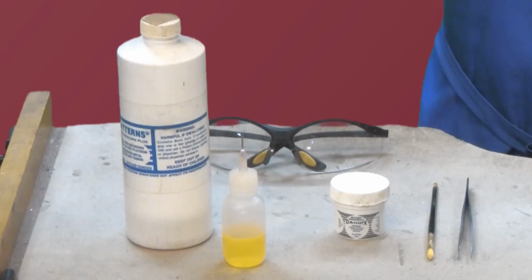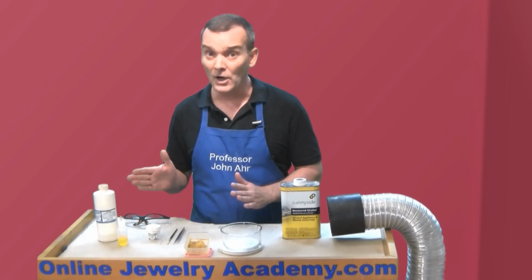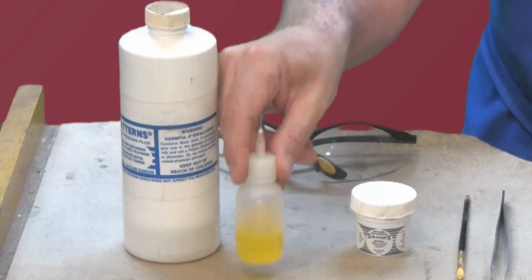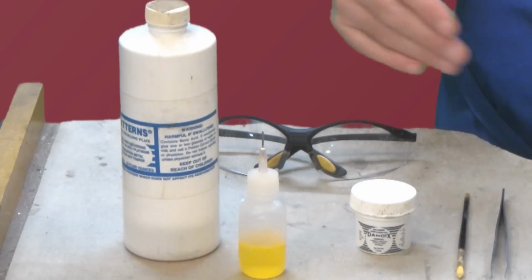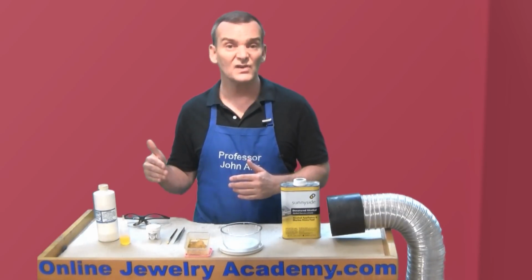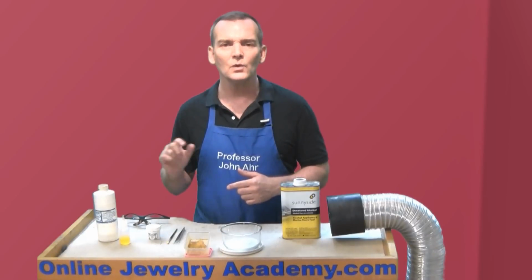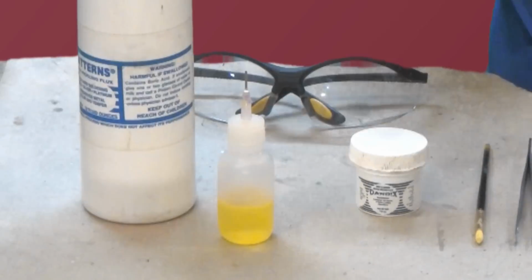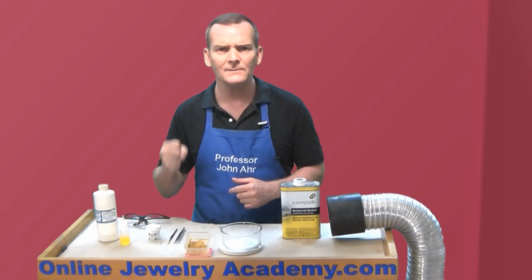So let's start first with liquid flux. Now, there's a lot of different varieties of liquid flux on the market. They all tend to look similar to this. They're just kind of a thin liquid with a unique color to it. And what this is used for is high temperature soldering. So you could solder gold, platinum even, silver, but it's formulated to work best with hard solder, a high temperature melting solder. This type of flux will not burn away at a high temperature. It'll stay put and keep working hard.